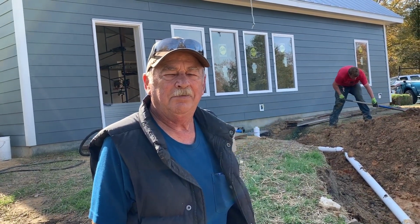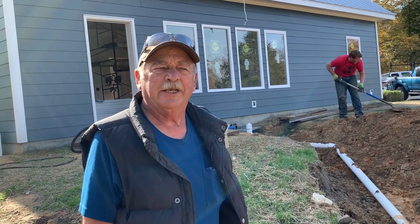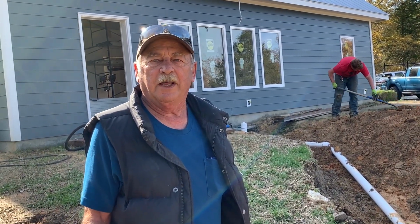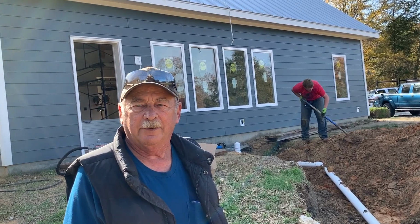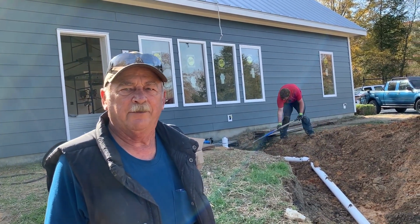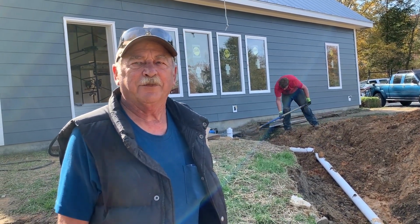Now, do people still use gravel for certain instances? We put gravel systems in where there's going to be like a pasture, where there's going to be livestock or horses. Then we'll put gravel in, because if it got wet, they could disturb the alternative system. And gravel they won't. Gravel is harder, more stable. So that's the only difference in them.